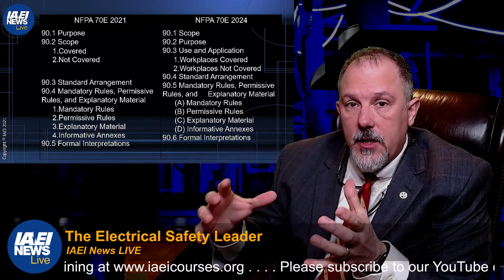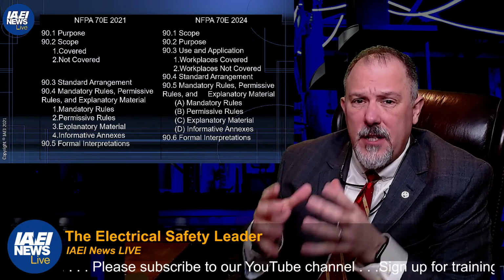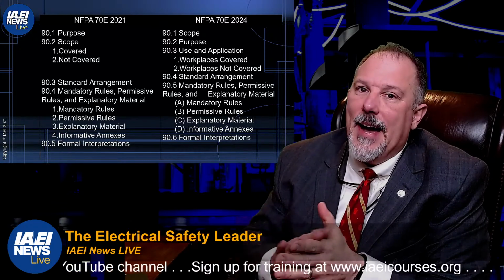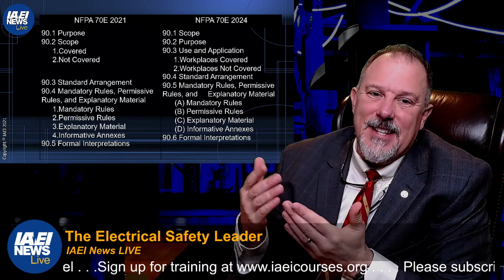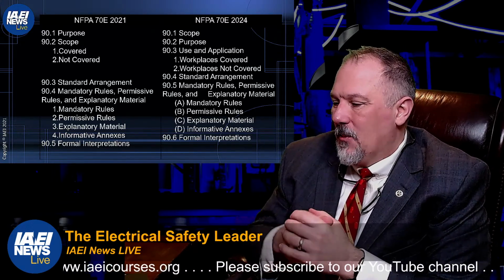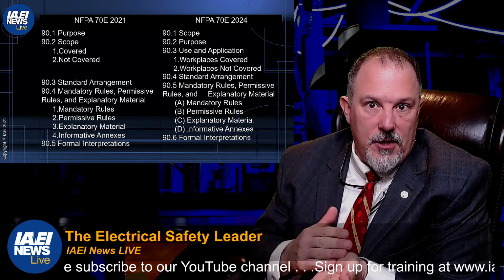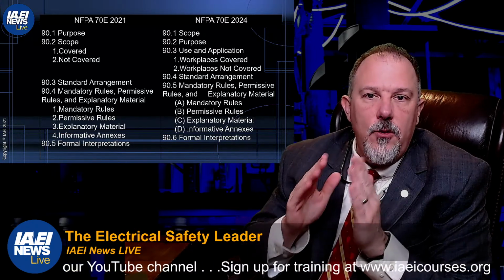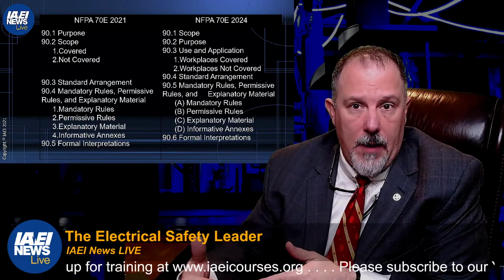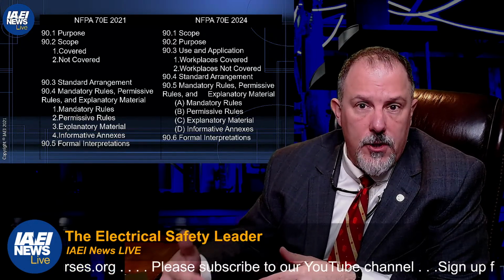Remember, we've got to put ourselves in the mindset or in the frame of thought. When we're in an article, you have to understand what it pertains to, and the scope statements help us do that. Because they added these scope statements, the 90.1s and 110.1s and 115.1s and chapter 200.1, all of these scope statements are causing all the numbers to shift. So if you create documents, if you have educational materials, if you have booklets, if your safety program references specific sections of 70E, you're going to have to update those documents, right?